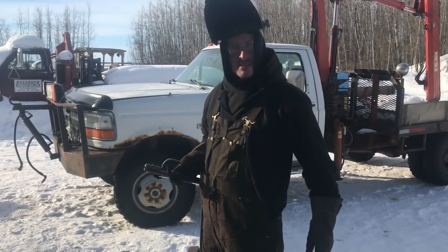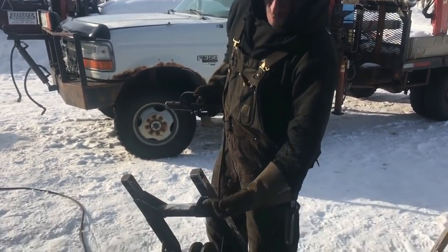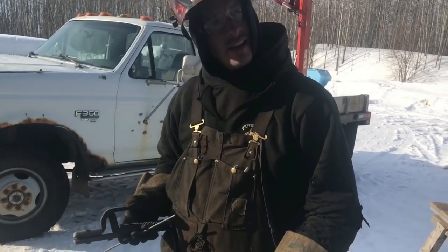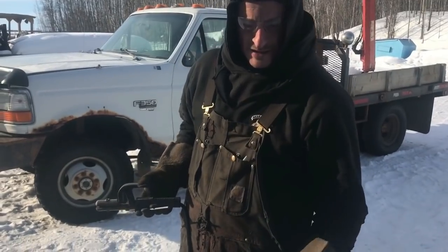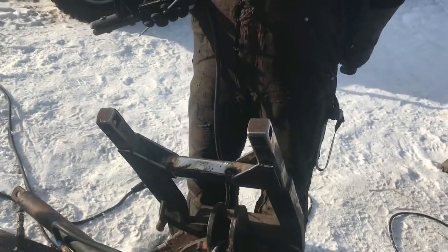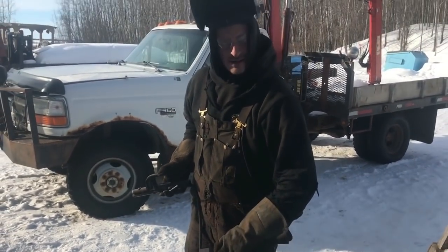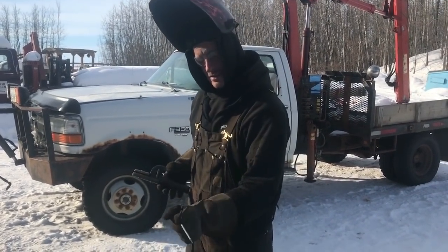Okay, if you want these plates to be at its strongest and not creating an additional weak point, we won't be welding across the tube on either of these because they can form like notch lines or possible places where it can break. So the strongest part to weld these is actually just along the seams and inside. That's it. That's way more than enough, and you'll never tear that out. And then you don't have to worry about constant jarring for it to break here. So don't weld those. You'll save yourself some hassle next time. It's gonna have a little bit of flex.